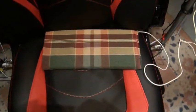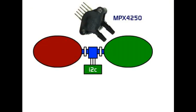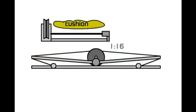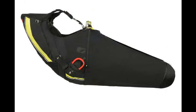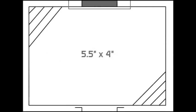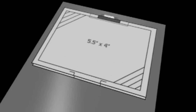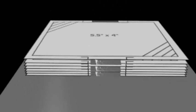Next and most interesting is the weight shift sensor. I thought of many methods for this from conductive rubber sheeting to air-filled bags with a differential barometric sensor or a miniaturized mechanical gear or pulley set. The main criteria is that it needs to work on both the office chair and in the harness, so it needs to be as flat as possible. The obvious choice was to make a pair of capacitive pads. I printed up some paper templates to stack in layers with cut aluminum foil in between. I went to seven layers which, according to calculations similar to a compression type capacitor, should be more than enough to get into the two-digit nanofarad range.